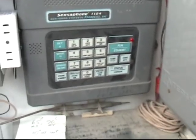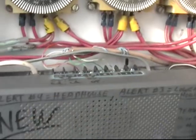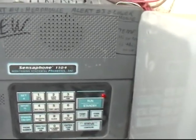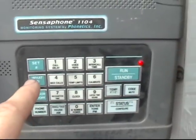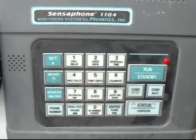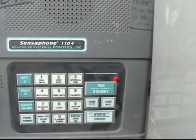It's pretty neat how this works. Should an alarm trip, or should one of these circuits be completed by a thermostat that is in another part of the greenhouses, or in the other two greenhouses down the hill, this alarm will then start calling our cell phones and our home phones. For example, say the temperature were to get too low — low temperature limit 55 degrees, high temperature limit 95 degrees. So say the temperature were to get too warm or too cold.